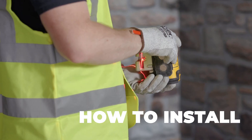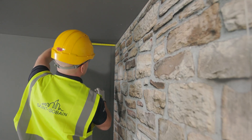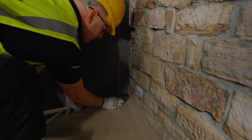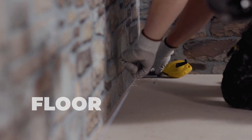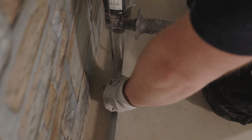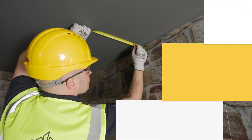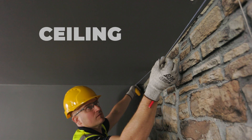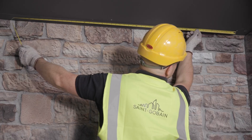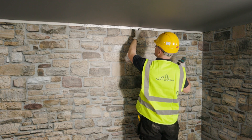So how do we install it? Measure the required distance from the wall, accounting for the thickness of the insulation plus an additional 20mm for the floor channel. Use a chalk line to mark a straight line for the position of the floor channel. With the line at the front of the channel, fix it to the floor through the channel's pre-drilled holes. At the ceiling, repeat the process ensuring that the head channel lines up directly above the floor channel. Before fixing the head channel, ensure that there are grounds sufficient to fix it to.